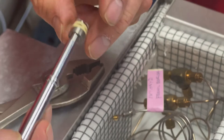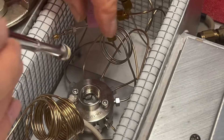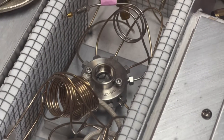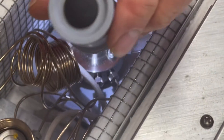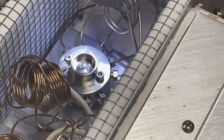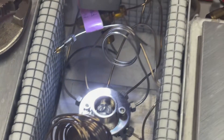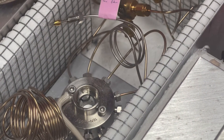When I put it back in, let's say I clean the dirt out. This doesn't look bad enough to really make a big deal about at this point. But you should look in the valve itself, because the surface that this rotor rotates against has to be extremely smooth to avoid leaks from one hole to the other. So it's a good idea to take a flashlight and look inside here. As long as you've got the rotor out, look inside and you can see. I can see that there's a place on the valve that looks like it's worn a little bit — instead of being shiny, it's kind of rough looking.